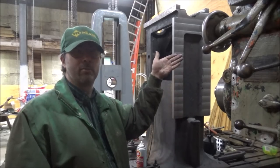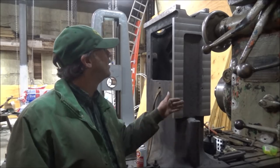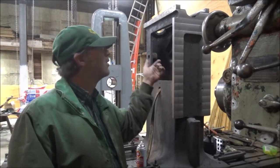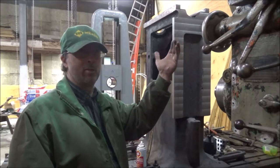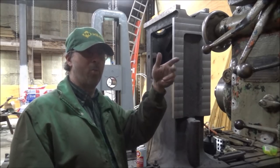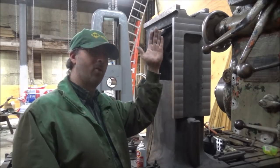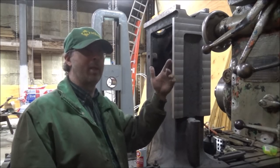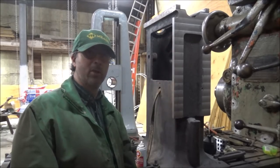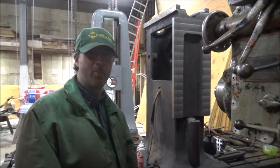You can feed up into it if you were trying to cut a slot, and perhaps it would be of some value. Although again, if it feeds up and it goes in at the same time, it's not really gonna make any difference because the shaper ram's gotta come in and usually it has to go back out on the other end in order for it to cut. You can't just go into a blind hole typically. And if it did, it would just tip in, so your blind hole would get deeper as it went down, which I guess could be problematic. Your cutter could hit the end of the bore if it was flat bottom. But I feel like you always need clearance with a shaper and that you couldn't go dead to the bottom of the hole. But maybe I'm wrong about that, so y'all can tell me.